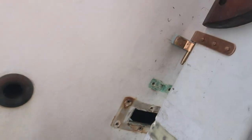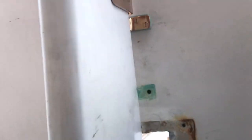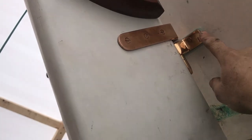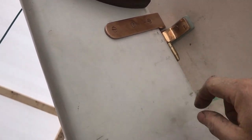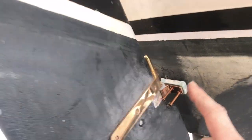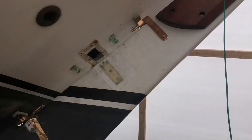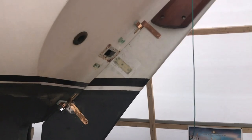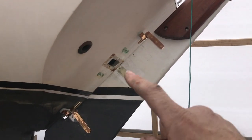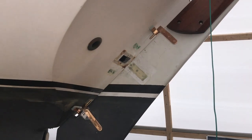I've made a bit of a spacer between the transom and the gudgeon here, made of G10 board. Also for the middle one as well, which is not screwed in yet — they'll be painted of course. At this point I think I'm going to pretty much call this complete. I'm going to close the holes here at a later date, and also do some fairing and painting.